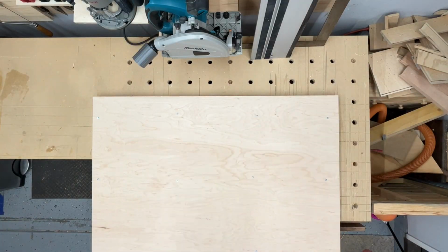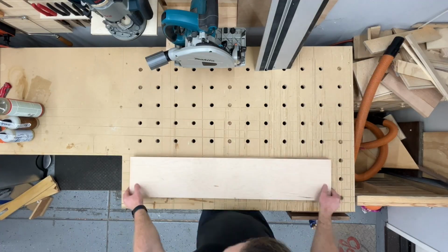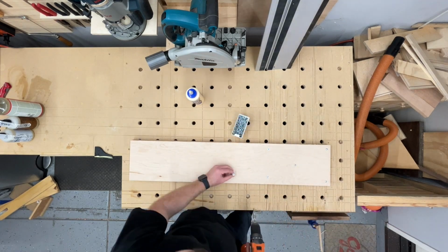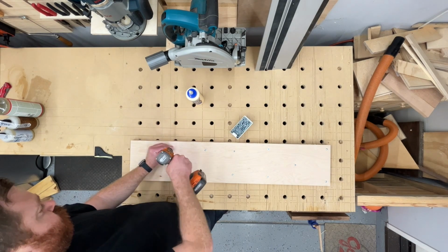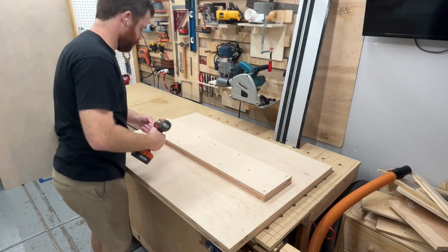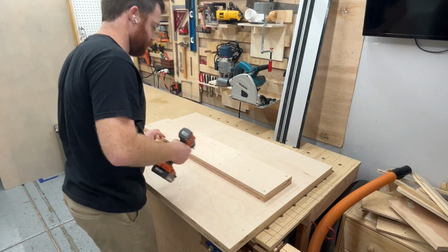So right now just laminating them and screwing it in with, I think they were just pocket screws that had a nice flat head on it. And I needed a little extra, so I just laminated an additional piece together. And once these were dry, took out the screws, and then we will cut this up here.